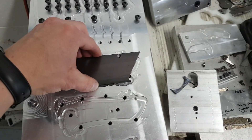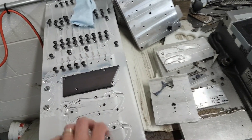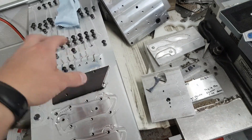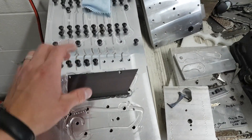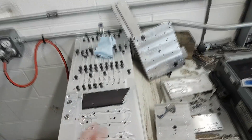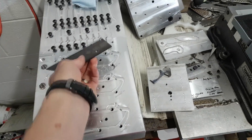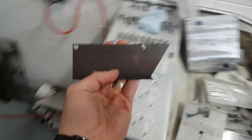I don't like it anymore — I want to change it up. There are five different operations in a Norseman blade: put the bolts in, put a clamp here and take some bolts off, put a clamp here and take some bolts off, put a clamp here and flip it, put a clamp here again — five operations. It's dumb. I'm pretty sure I can do it in two, maybe three operations, which will just make everything a lot easier. The rasp blades are a lot simpler, so this way I can do three blades, flip them, and be done.